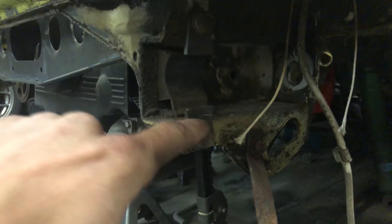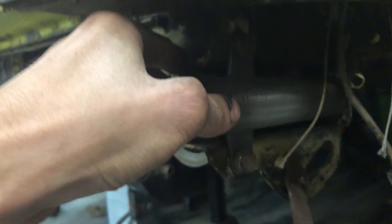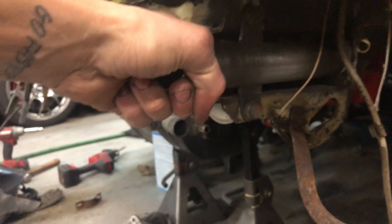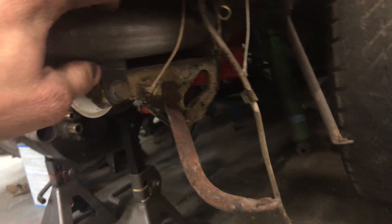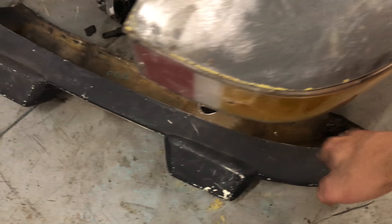I took these tabs that I've had pre-made - I usually order a bunch of these with a couple different bolt sizes - and I just chopped them down so the tube fits snugly in between, very snug actually. That's getting welded there and there obviously, and then there will be a bash bar that is just one single bend.